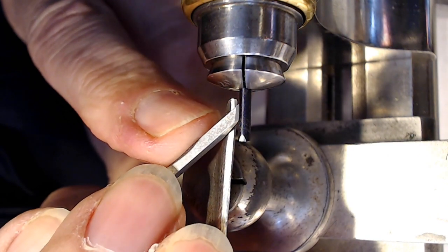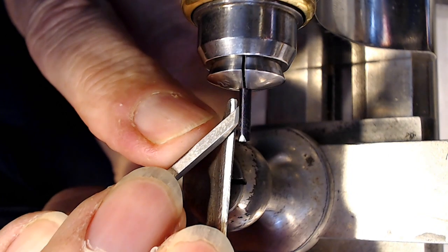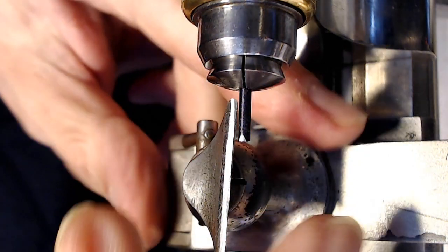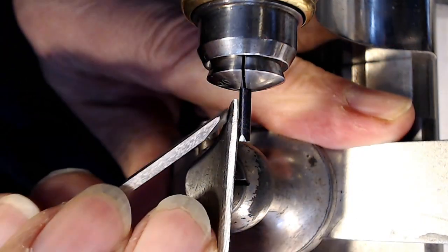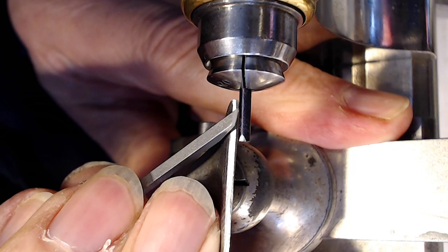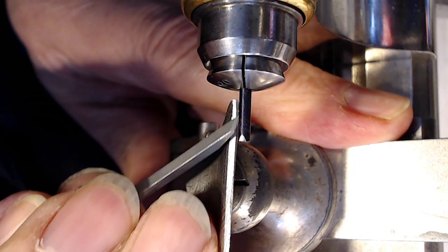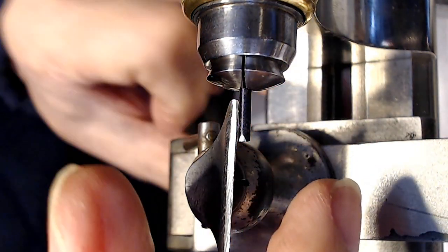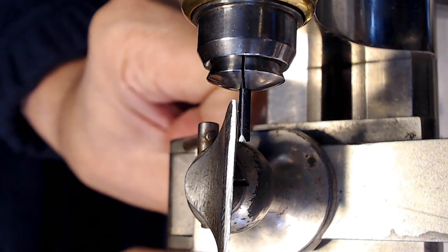But that's just a preference, though. So that's not too bad. I still have a little bit of distance here between the tool rest and the graver, so that's perfect right there. That's the perfect distance to remove material. So, and I think I'll just tighten this up, and I might want to lower the tool rest